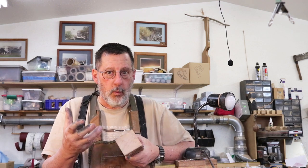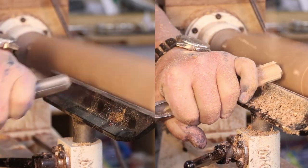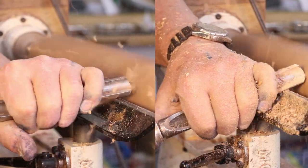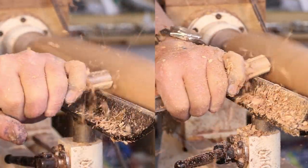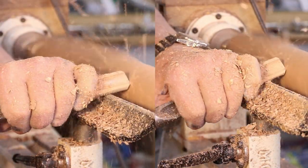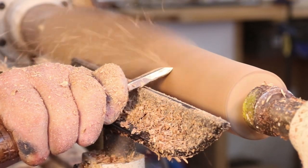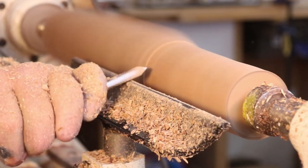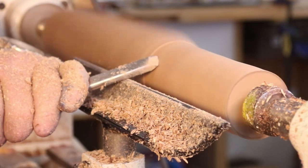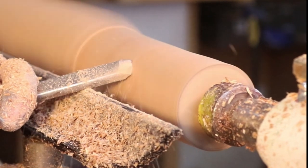It's a little bit easier to use a piece of green wood like a limb and turn it, but I didn't want this to start warping midway through turning the stem. I'm sorry about the music, but I just didn't know what to say about a guy using a spindle roughing gouge. Here I've got a skew chisel and I'm just sort of practicing, taking that wood down to a nice level smooth surface.